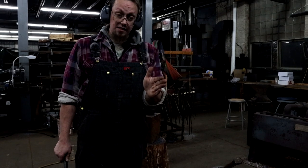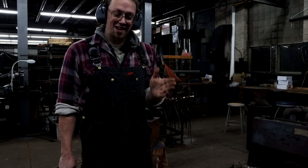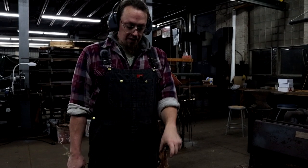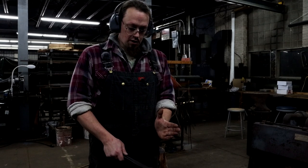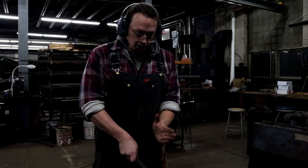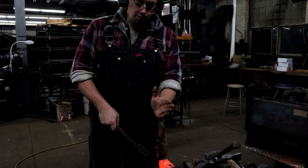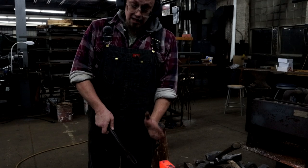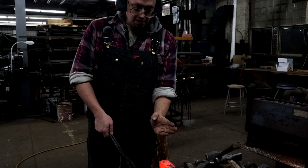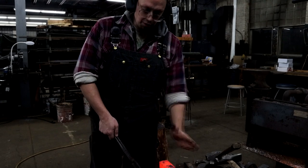This is something that's very, very common. If you're trying to slit a hole through a piece of steel, and like this, if your hole is even a little bit off center, you're suddenly pushing your chisel against this really, really thick mass as compared to the slightly thinner mass over here, which means the chisel will drift that way and buckle this end out. So you want to make sure your lineup is really, really steady and your chisel is going straight vertically in, because any change will start to force your hole off center or just drift the whole thing offline from what you want.